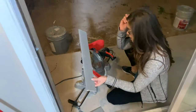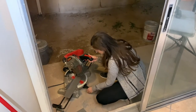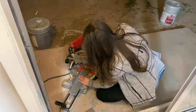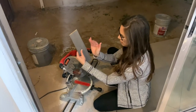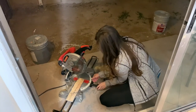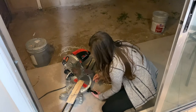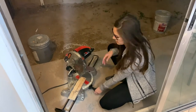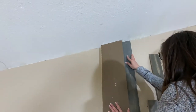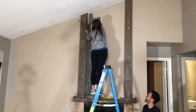So I need to make my straight cut and then my angle cut so that it's even. I have to set my miter saw to square. First I'm going to do my 90-degree cut to get it even. We want this shiplap plank on the right-hand side and the 20-degree angle to go here — so we're going to flip it to get the angle cut and then adjust to 20 degrees on the saw. Tighten it up, do our cut, and hope for the best. We should have perfection — and we have perfection! Look at that!